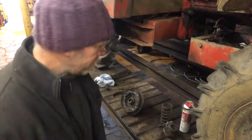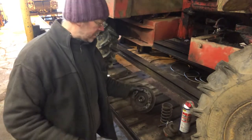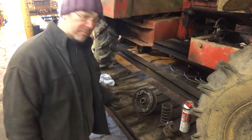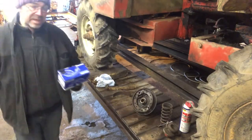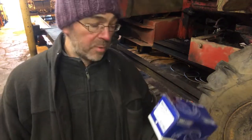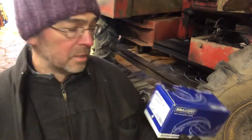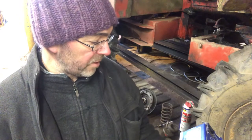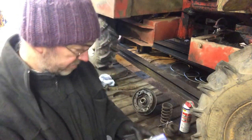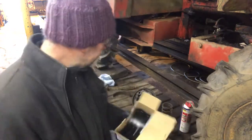We're back, we're going to try and get this back together and put it back in the dumper truck and hopefully get it to work. I've ordered the brake shoes which are here. They are the same as the Triumph Herald rear brake shoes and Spitfires - Reliant three-wheeler, Herald and Spitfire. They're the rear shoes, and it's an axle set so there are four shoes, which is twice as many as I need, but these are the ones.